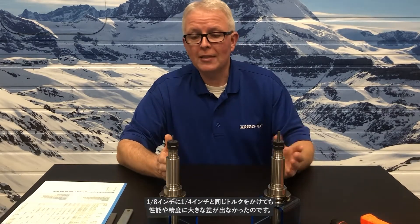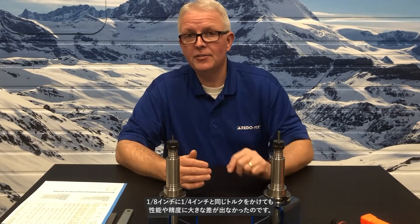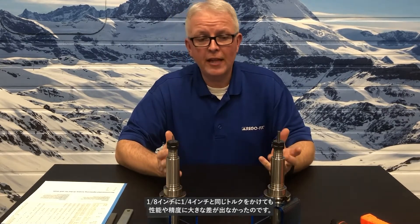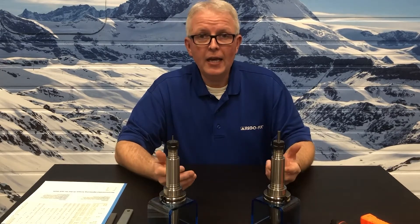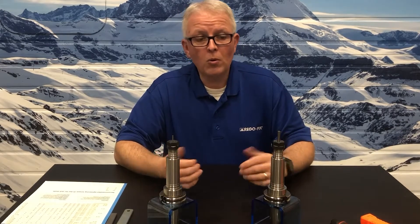Why is that? Up until recently — up until the invention of the Hi-Q nut, or the friction bearing style nuts — you couldn't transmit enough torque into the assembly to make a difference. So, it didn't matter if you applied the same torque to the eighth-inch as you did the quarter-inch. The clamping nuts being used just weren't that efficient. Today, with the Hi-Q nuts and the friction bearing nut styles that are offered, nut torque is a lot more important.